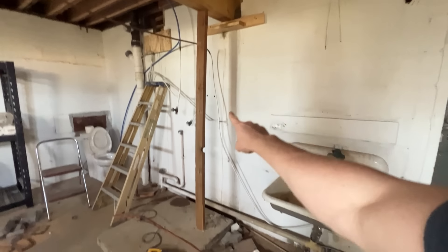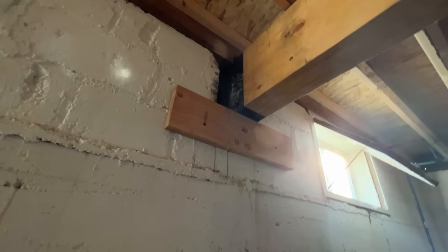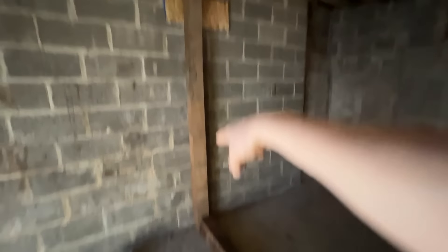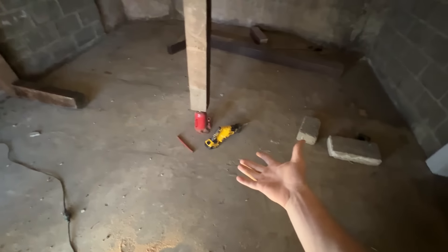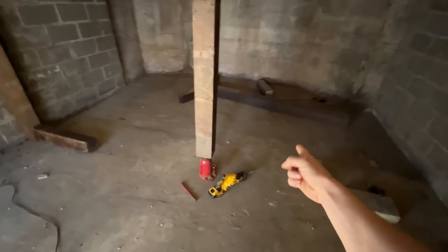The concrete is doing its thing, running all the way down the inside of the wall. In the back room we did get the other beam up. This one looks really good — we have the exact same thing going on, bottle jack holding it up right in the center, everything concreted over. We do have extra temporary supports just in case that bottle jack gives out. They sent us too short of a board, so we're not actually square with the wall — we're sticking off about that far. But it's not going to be the end of the world because we're going to be doing a demolition of this concrete floor at some point to put floor drains in. The plumbing currently runs right on the other side of that wall underneath the floor, and it is over 100 years old. Plumbing is typically rated for a 50-year life, so that is definitely well overdue.